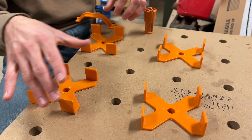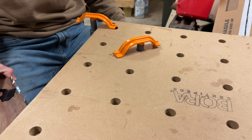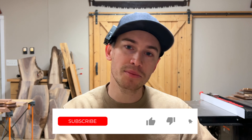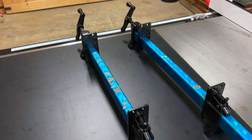One of the accessories you can get with the Bora centipede system are two-by-four holders. If you want to hold two-by-four rails straight in line on the table, a two-by-four will fit perfectly on its face, or turned on edge as well. One application is running a two-by-six as the beginnings of a DIY router sled for flattening huge pieces of wood — a two-by-six rail on each side with a perfectly flat table in between, then just run your router back and forth to flatten slabs. Another nice accessory is hold-fasts that you can lock your workpiece down with.